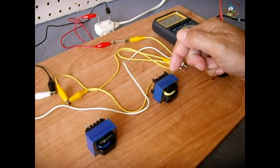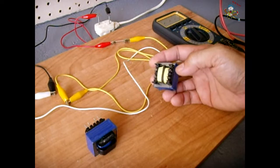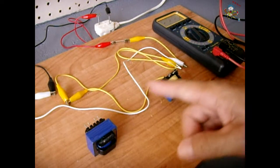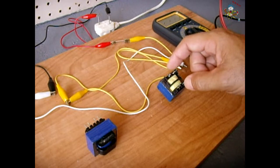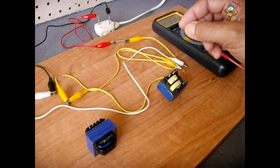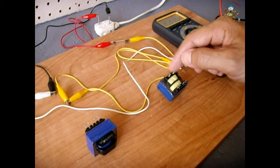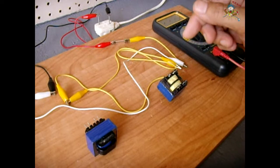The primary is 120 volts and the secondary consists of two separate windings — 11 volt and 7 volt. Both transformers are wound with the exact same gauge wire on the primary and the exact same gauge wire on the secondary. That is extremely important. The gauge must be the same, the cores must be the same, and the number of turns must also be the same in order to achieve good results.